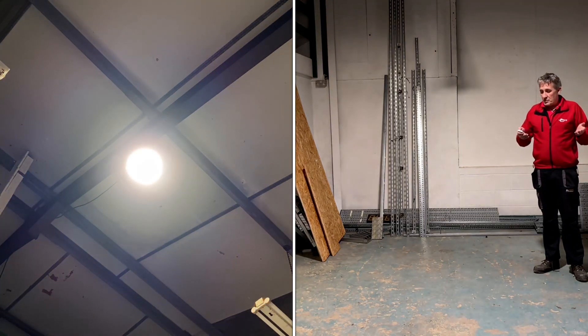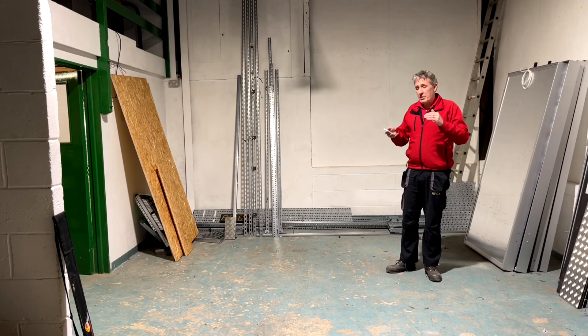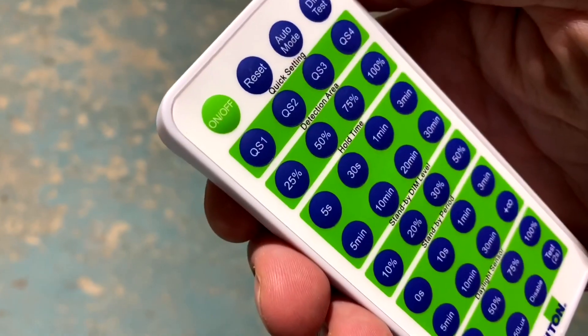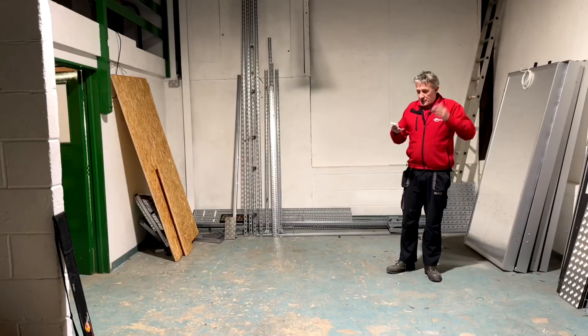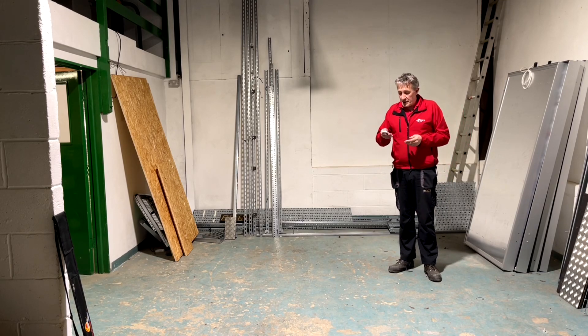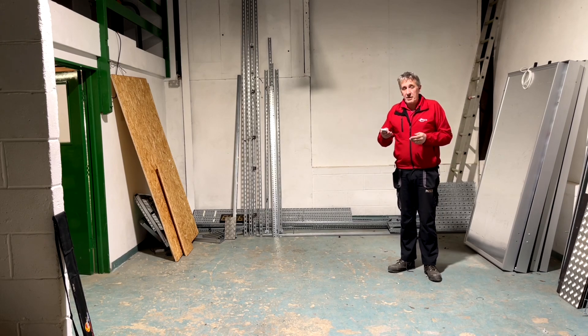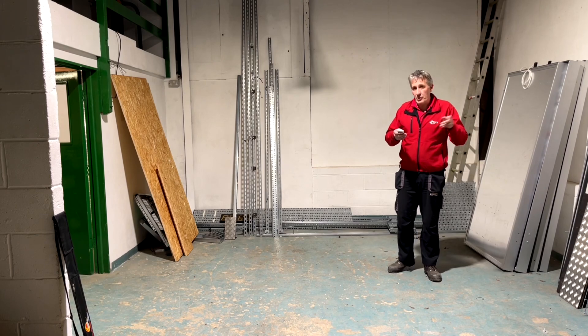Or perhaps I want to go lower — down to 10%. I can test that as well. Then we can set how long it stays in the standby period — always on, or a timed period. I'll do a little trial now: I'll set the detection area to 25%, the hold time to five seconds, the standby period to ten seconds, then leave the area and watch what happens.